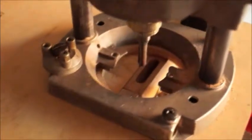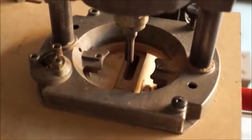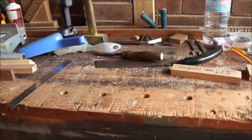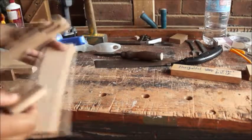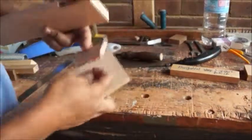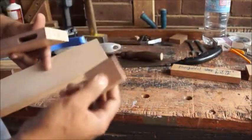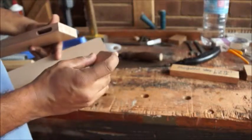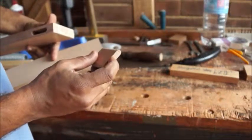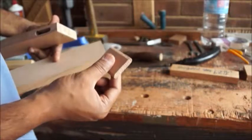Once we've gone through and made the mortise, this is what it should look like. Now it's time for assembly — putting the joints we've just cut together. Here we have the stile part and here's the rail part. Here's the loose tenon that I've cut. The loose tenon is made from the same stock as the original wood, and the thickness is exactly the thickness of the router bit you've used. So if you've used a quarter-inch router bit, you would make sure that this tenon stock is a quarter inch thick.